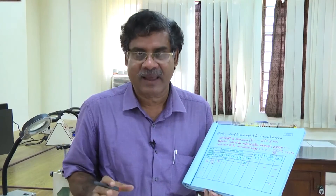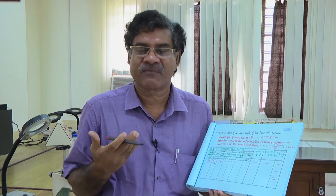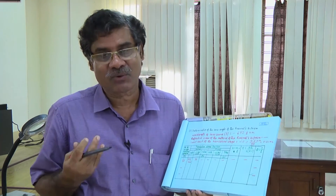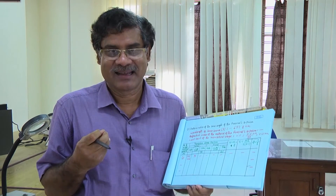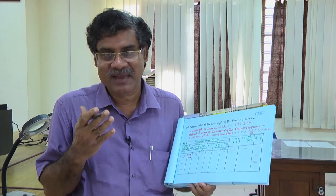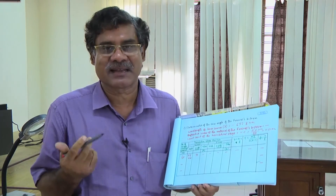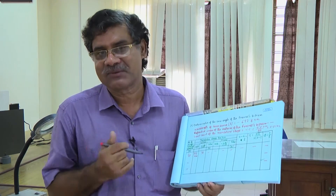I think I have demonstrated the Michelson interferometer — how to measure the wavelength and how to measure the angle of the biprism or refractive index of the biprism. We also got the feeling of how fringes are collapsing or appearing depending on the distance of the mirror or the thickness of the biprism. The biprism has a variation of thickness — just by translating it you get variation of thickness and change of optical path.